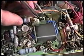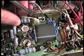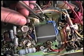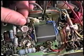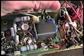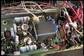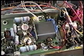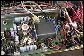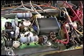The screw right here, you can see the board is now loose, but if we don't take this out, when we pull the board up we'll pull this little thermistor loose and break it. We don't want to do that because we would have to glue it back onto its little holder. So we take this screw out, place it just off our edge of the template so we'll know it goes on the heatsink. And now this board will lift up.